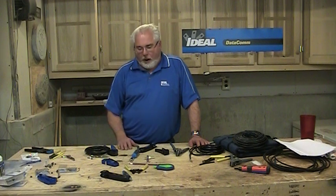A great example of where wire size might change on you is a component video cable that goes from the back of a set-top box to the TV or DVD player. Those have three little connectors — a red, a green, and a blue RCA connector — and if you ever cut that wire in half, you'd find out it's mini RG59. It's a small piece of coax.